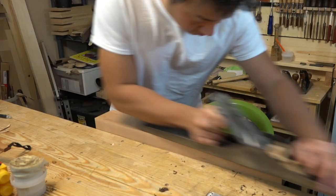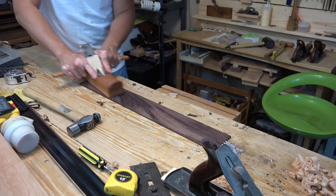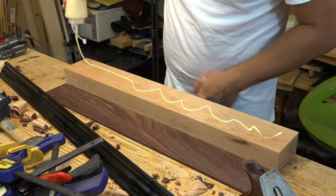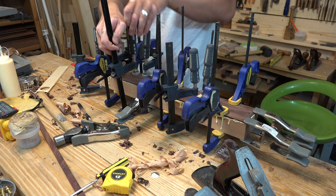I started the project by squaring up a piece of cherry as well as a piece of rosewood. The cherry is for the top — it's stable and a little softer and easier to work with. The rosewood is for the sole of the plane; it is also stable but very hard. This laminated block is about 24 inches long. Eventually I cut it down to 15 inches because I realized a lot of my large planes just collect dust.